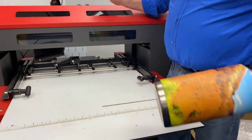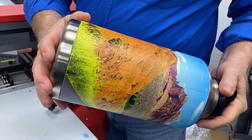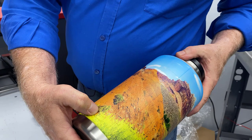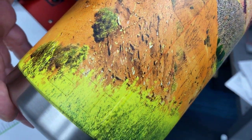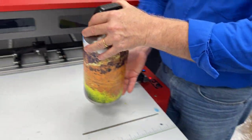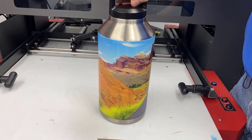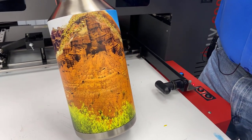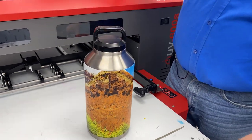That's something you could add thirty dollars to a piece of metal like that just by adding that much ink to it — pretty amazing. Looking at this, you can see where the Yeti branding was covered up; it looks almost textured onto there. So there you have it: full wrap on stainless steel. We cleaned it up with acetone and a metal promoter on top, and it had great adhesion and great registration all the way around on that print.